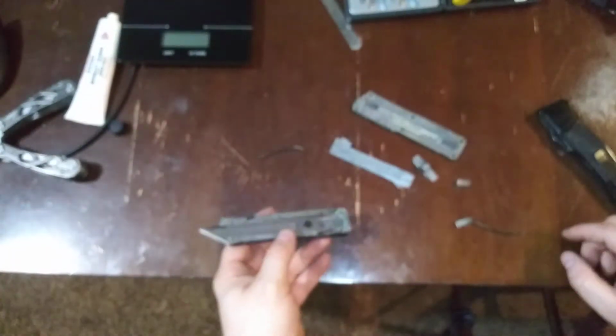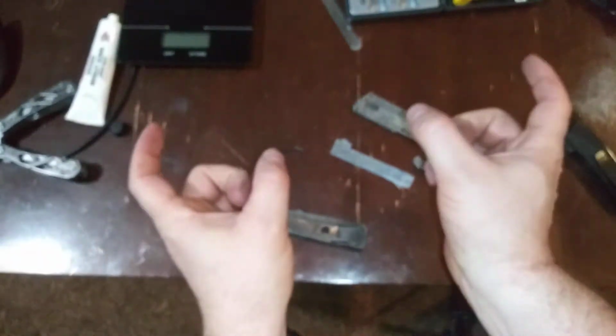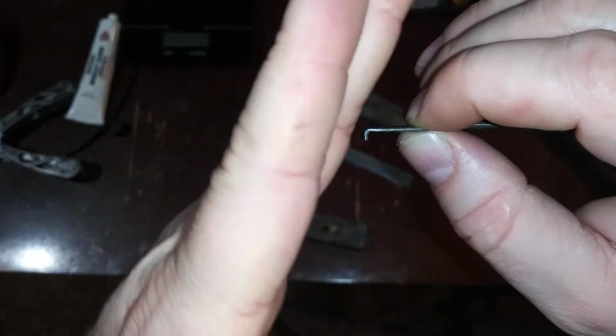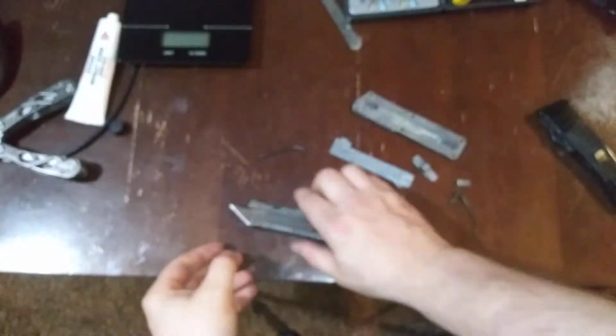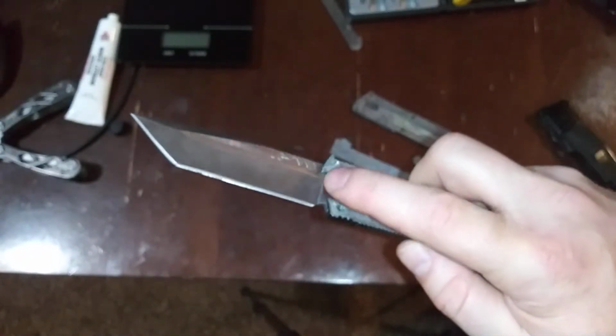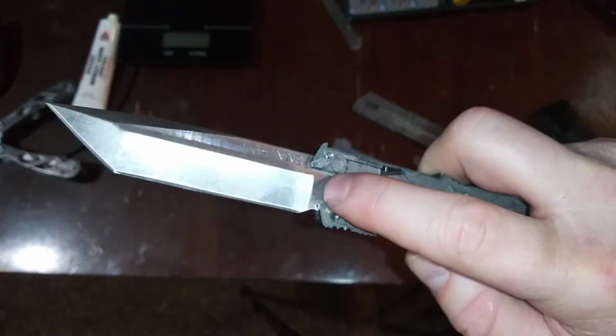So essentially, this is my theory, that the hooks break. And what I was able to see on the front hook was it was a clean break. It bends the hook out just a little bit. And that's how I noticed I had a problem, is that it was cracked to the metal, and then it allowed it to be maybe more at a 45 instead of a 90. And what that did is it gave like an extra millimeter of slop between the hook and this circular piece, so it wasn't pulling it tight, so it was sloppy.